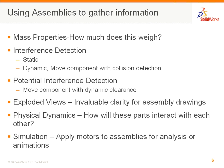For the greatest efficiency use of assemblies, we can ask SOLIDWORKS to give us information based on our assemblies, in addition to, gee, will these parts go together and how will it look? Well, we have the option to do mass properties. That takes the volume of each part times a density, which is based on the material, and calculates how much this part would end up weighing. Now, when doing this at the assembly level, this is assuming, much like the part level, that the accurate material has been assigned. So for the assembly level, an accurate material has been assigned to every single component in that assembly.